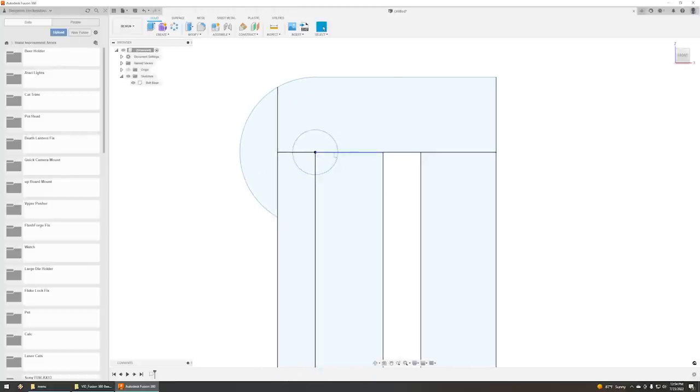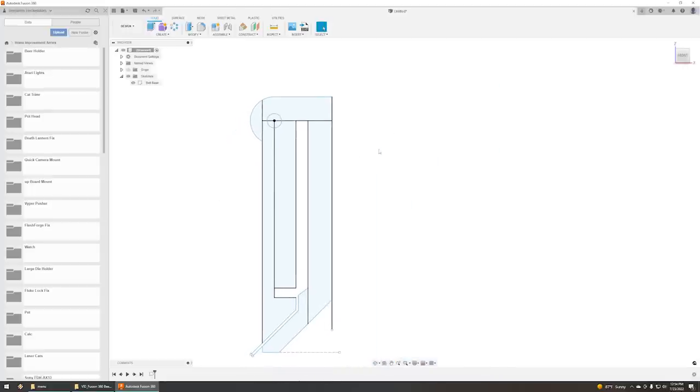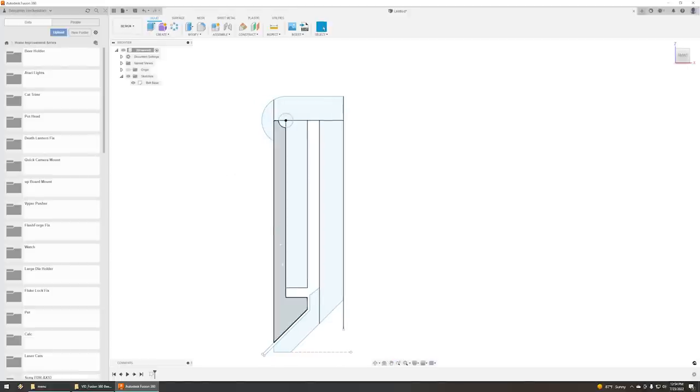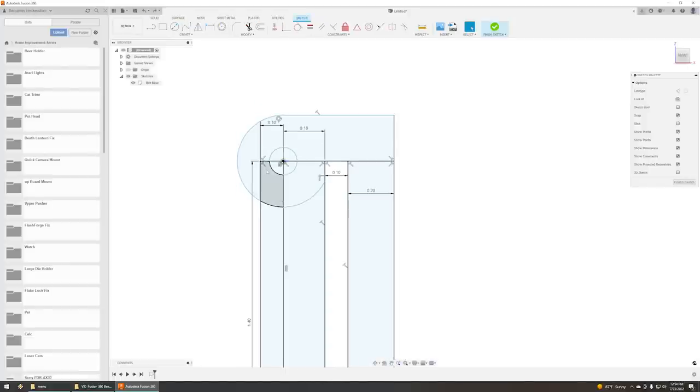So this is where the belt is. So this will give it kind of like a place to pivot. So this will act as kind of like a little bit of a spring. And then, of course, I'm going to want to print this laying down so the striations are going lengthwise. You know what? I'm going to change the position of that circle because I want there to be more mass at the top of the belt because that's where this thing actually sits.